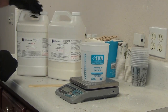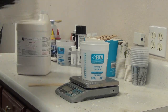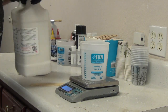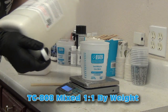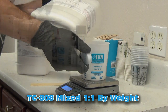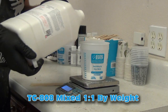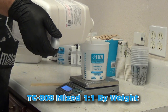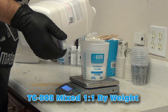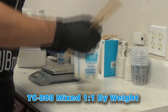For the skin of resin inside this mold I'm going to be using TC808. This is one I've used in several previous tutorials — it's kind of my go-to for this kind of thing. TC808 is a very moisture-resistant, fast-setting formula that is incredibly strong and works really well for hand rotational casting, because you don't want a resin with a really long working time if you're going to be hand rotationally casting.